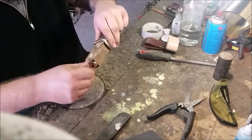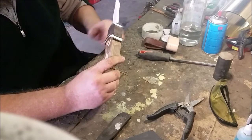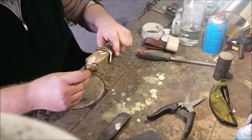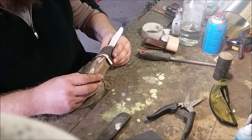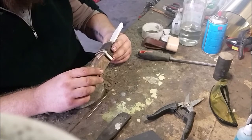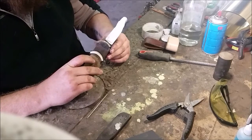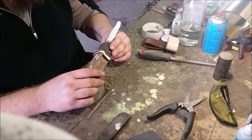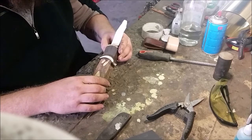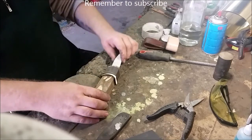As it tightens up I can see it's all taking shape. We don't want to over-tighten it — we don't want to risk breaking off the end of the tang. And yes, that looks very cool. I'm going to glue it — I won't show you that part since you should all know how to glue a handle together. The epoxy fills up all the small gaps. You can see it's got a really neat fit with no gaps. Any small gaps will be taken up by the epoxy, and once I've ground it all clean it'll look very smart. So that's how I fit shimstock spacers for my radiused stacked handles. Thank you very much for watching — please subscribe.